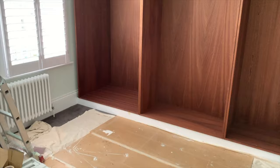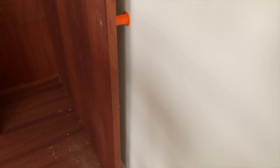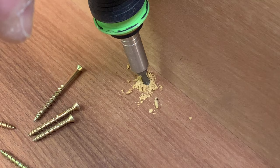With everything screwed together I want to fix the whole assembly to the walls at either side, and I'm using space plugs to do this — the first time I'd used them, as mentioned in the previous video, and they work extremely well. Because I've moved the carcasses over slightly to accommodate the shutters, the longest screws I had were a little shorter than I'd like, so I glued blocks of scrap wood to the wall with fast-setting PU adhesive and fixed into those. On the right-hand side the gap is narrower so I had to cut 12 or 15mm off the space plugs. These screws will be hidden behind the hinge plates when fitted. The last thing I do is screw the carcasses down onto the plinth with a couple of Torx-head screws with a particularly small head that I can easily conceal.